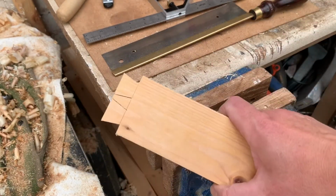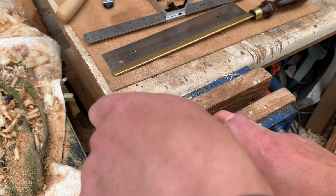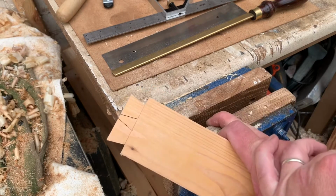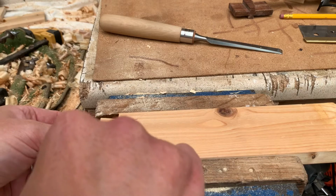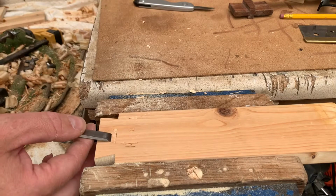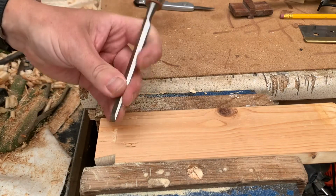Right. So now we've got the issue of cutting this centre section out. Now, some people go in with coping saws and try and slot down there and turn it, and then try and cut across there and then have to chisel it out. I don't do that, because you have to chisel it out anyway. So I just use a cut to cut technique, like we did with the carving stuff. So get the knife mark in there, and then just go in with the chisel and just chip, flick it out, and as it gets deeper you can chop into that knife mark.